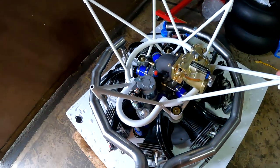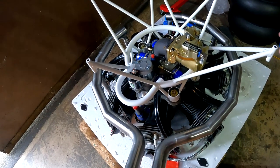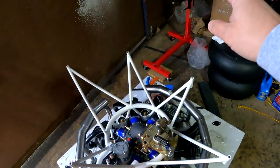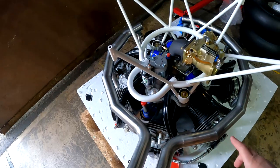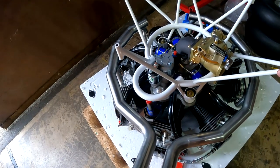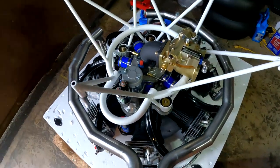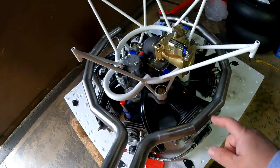At the end of the last episode I had just finished picking up this powder-coated mount, and I also got the landing gear powder coated — I'll show that later. I took the engine off of the engine mount with some help, put it face down on the foam so that I could put on this motor mount, test fit the exhaust, and test fit the fuel injection system. The rubber isolators and hardware are attaching the motor mount to the back of the engine right now.